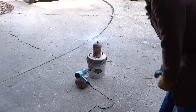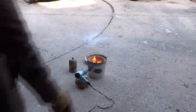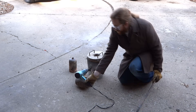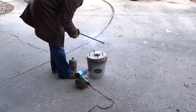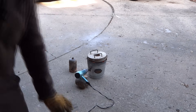One thing to remember: the old plaster sand lining was fairly insulating, but this one is not. I just started it and the outside is already over 100 degrees, so don't touch it. For the crucible, I'm still using the extinguisher. Now with that heating up, I'll add the heat sink and this plate. The plate doesn't fit through the hole. And let it burn.